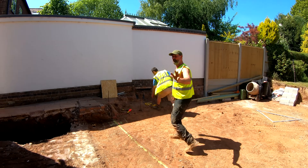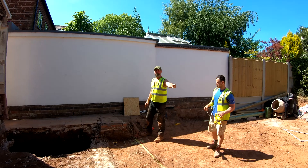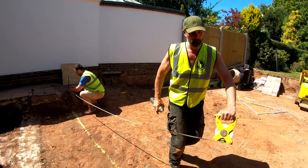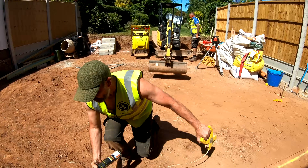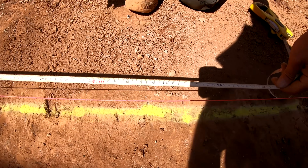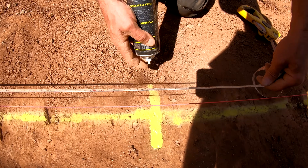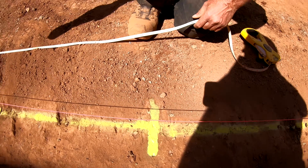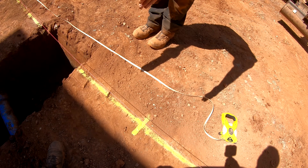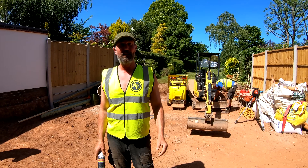So that represents from the outside of that building on that side to the edge of the footing here — is 4 metres 50. That's what the drawing shows us: from this measurement here all the way to the side of the footing is 4 metres 50mm. So I've got the surveyor's tape — 4 metres 50mm. There's 4 metres. I'm going to give myself a little bit more concrete and go to 4 metres 1. So that means I've got to excavate with the digger from that point all the way along here to 4 metres 1, and then come off this section for the next part of the actual footing. This is all now being excavated. That's so good.